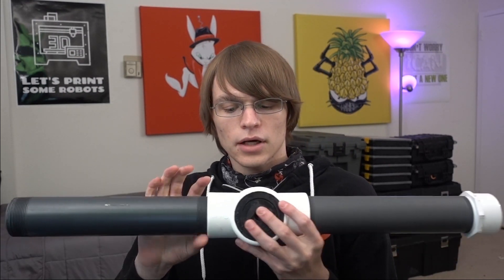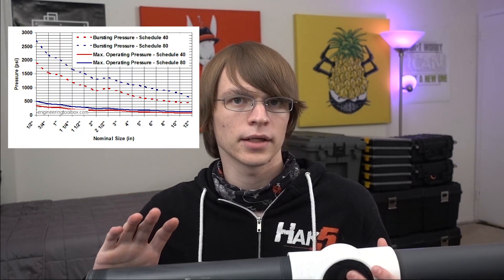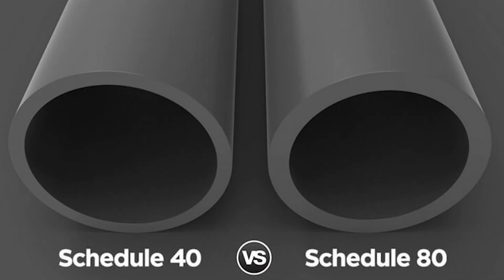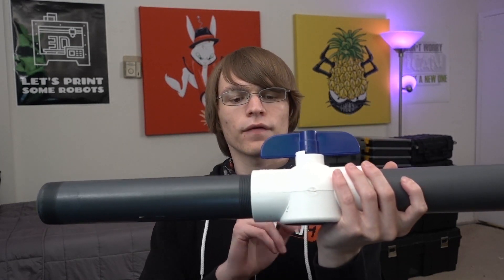Before we get into the new Cannon, let's talk about some flaws with the old one. Some issues were that it was made out of threaded pipe — Schedule 80 pipe, which is great for air cannons with higher pressure than Schedule 40. The walls are thicker, it's made out of a denser material, it's all around better. But one of the problems is I used threaded pipe. You can get all kinds of pipe dope, thread tape, and other things to make it seal, but at the end of the day it's just not that great. And on top of that, I used a 2-inch ball valve. These ball valves are really great for water, but they will leak a lot with just air. You can do different things to lubricate and make them seal better, but it was just proving to be a little too difficult to make reliable.